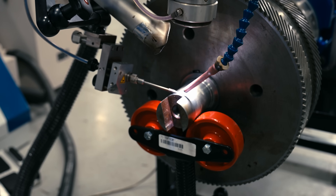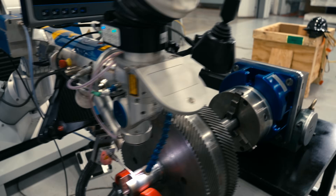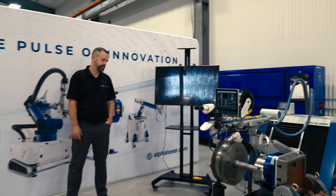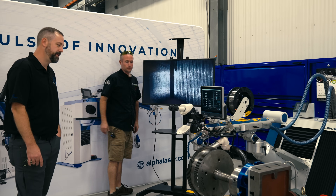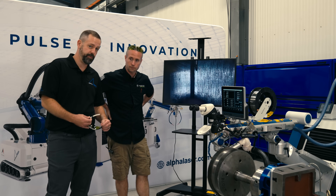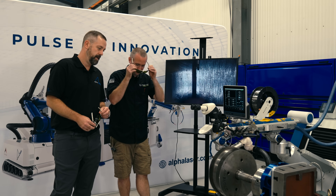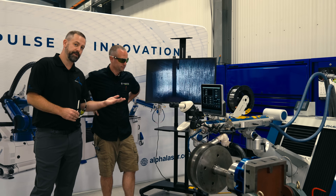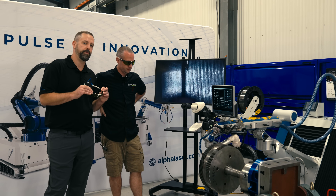With the ALDV, it has a very precise feeding head so you can really adjust it to get the precise angle and direction you need. Alex just turned on our fume extractor to pull the welding smoke away from his face when he's welding — that's very important. The other important thing when you're laser welding is you always want to make sure you're wearing laser safety glasses, both the operator and anyone in the surrounding area. The laser has protection built into it, but just as an extra precaution, the operator should wear these as well.